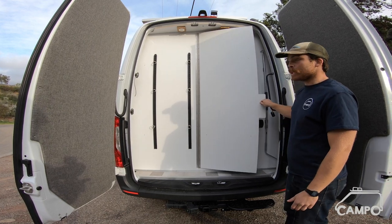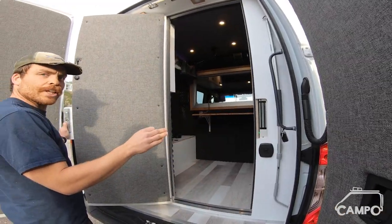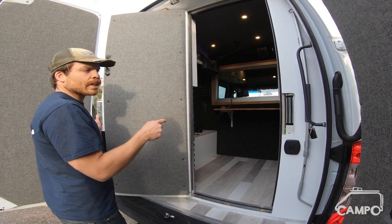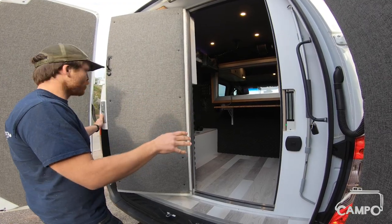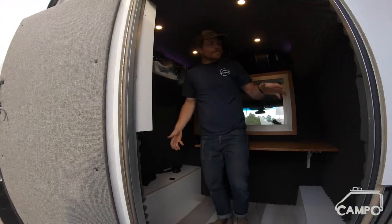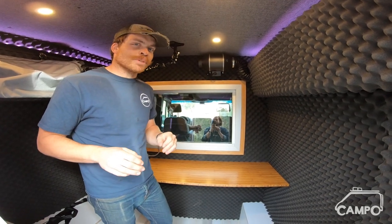So you click a little button — there's a little beep — and open this guy up. You can see our latch is a magnetic latch. Perfect application for this: one, because it can be easily switched from the other room and it's very secure. And two, it's a fail-safe. So if somebody's in this room and the power goes out, it unlatches. That's really important — we really don't want anybody getting stuck in here. And we've got three layers of sound deadening in here. I'd like to demonstrate how soundproof it really is.